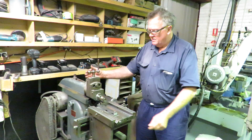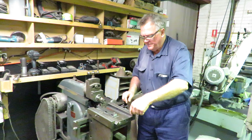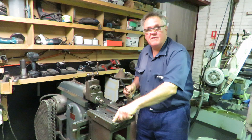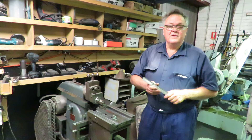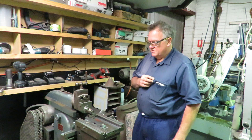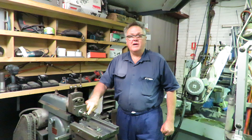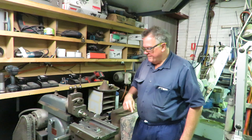We were lucky — it's got about a 10mm spare in terms of its stroke. I set the tool up parallel with this and reamed this one out. Then when I about-faced the object 180 degrees and set it up parallel with that, I was able to get into the other side. All it really did was just take out that extra little bit right in the corner that the mill cutter wouldn't quite reach. So this was a cheap alternative to buying a new cutter. One of the good things about the shaper is that you can grind these high speed steel tools to whatever you like — you can also rig up a boring bar to cut an internal keyway.